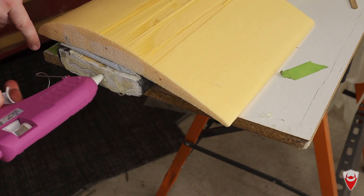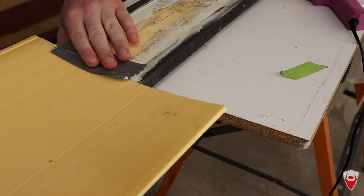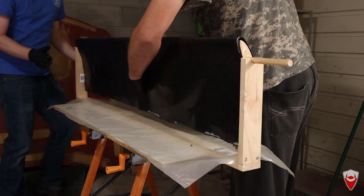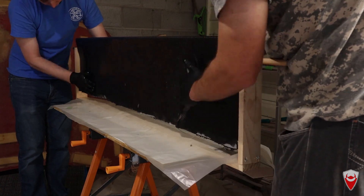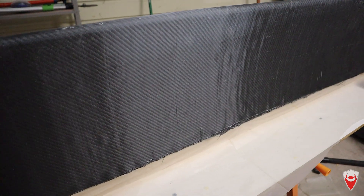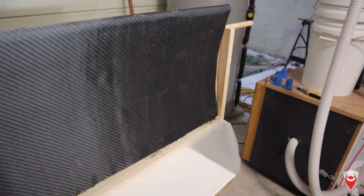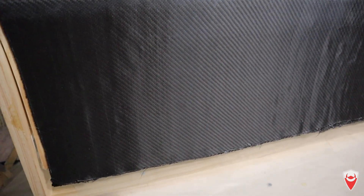So, into the lessons learned. First up, I should have listened to myself last time and used hot glue instead of Sikaflex — hot glue made everything so much easier. Second, and one of the most annoying, was putting too many layers on the wing in one go. Instead of doing that seven-layer layup and trying to smooth it all on at once, I should have put two layers at a time and stippled it in place. That way I wouldn't have had to do all this refairing and sanding. The wing was nice and thick, so I could afford to sand into some of those carbon layers, but it took a lot of extra time and wasted money. I should have slowed down and done two or three layers at a go to make sure there were no air bubbles trapped.